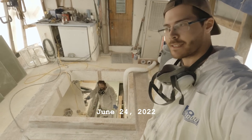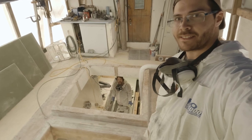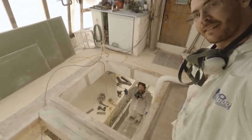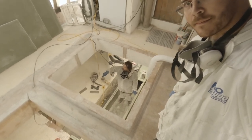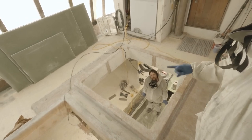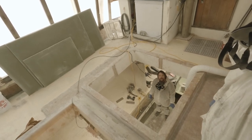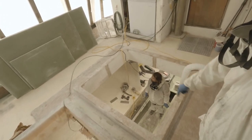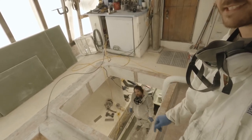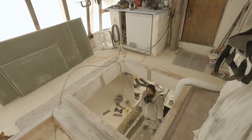All right, everyone. Welcome back. It's an exciting day. Yeah, plugging away down here. Just getting ready to glue in the second layer of our bulkhead, the two curved pieces that tab into the outside of the hull. We did a little bit of fitting this morning, general prep too. Drilled some holes in the bulkhead so we can put screws through and suck the two halves together, making sure there are no big air voids or anything like that.